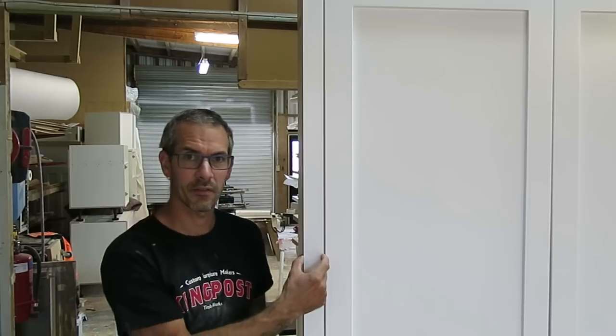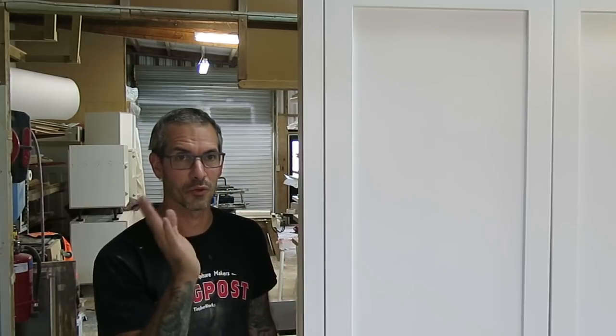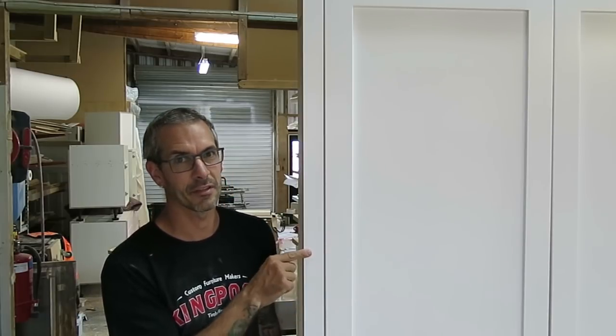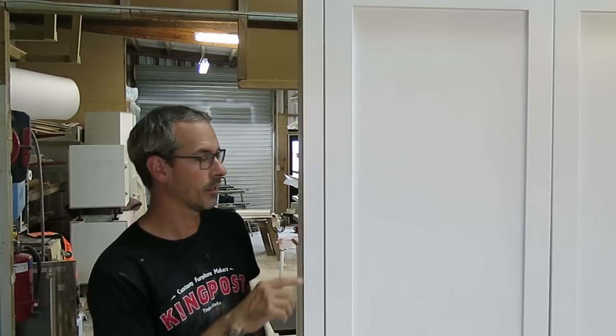Okay, the purpose of the scriber is to allow for the crooked walls in the house. The width of the scriber needs to be at least as much as the walls are out of plumb. But also keep in mind that you can create a border with the size of the scriber. In this case, they're about 5 to 10 mil too big. We'll scribe them down to match the wall on site.